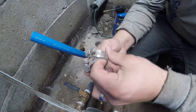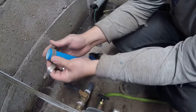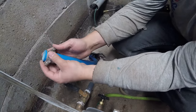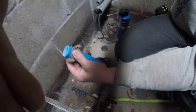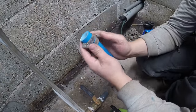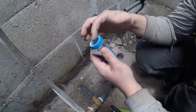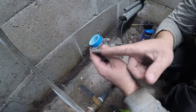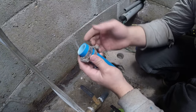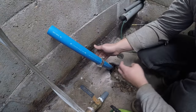You want some hose clamps? These are used ones but they're going to work just fine. When you put these on here, you want to use two — always — and put them in opposite directions. By putting them opposite ways, when you tighten this down it tends to pull the material of the pipe towards the point where the tightening device is. Put them on opposite sides and you're not going to create a crease along one edge. Get those slid on there so they're ready to go.